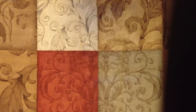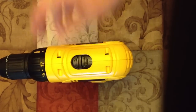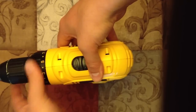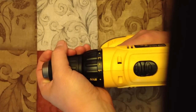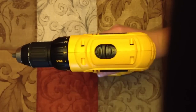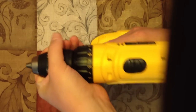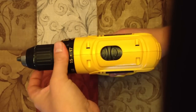Back to the drill itself: it is an 18-volt drill. You have 17 torque settings with two speeds adjusted here on top, and then you have your drill setting. Each torque setting is going to stop at that desired torque level. At setting 1, once you achieve a really small amount of torque it hits the release — that's what it sounds like when it hits the torque level. As you go past 2, 3, you get a bit more out of it.